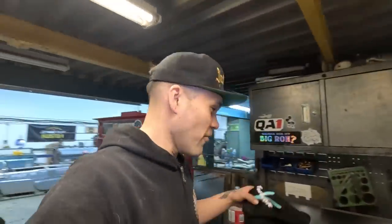Okay, I think we fixed our wagon, so to speak. So, here's the deal. What I was doing wrong, Elio helped figure this out, is that I was using fine cut consumables on something that is not suggested to be used for fine cut consumables. There actually wasn't a cutting chart on the program to use 45 amp fine cut consumables on aluminum sheet, and there's a good reason for that.